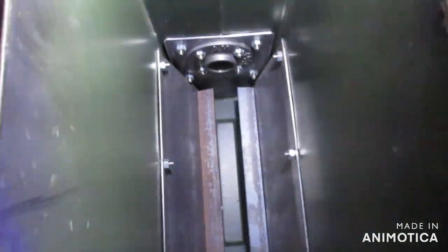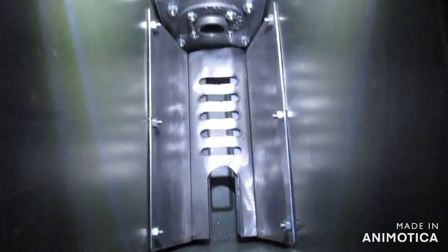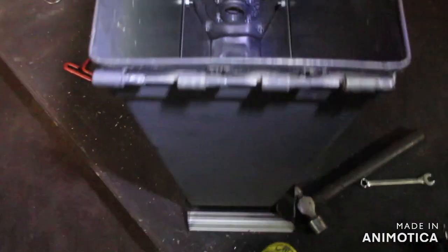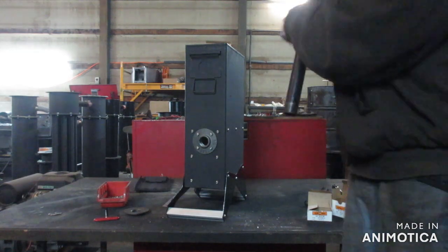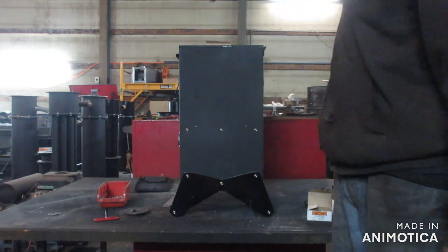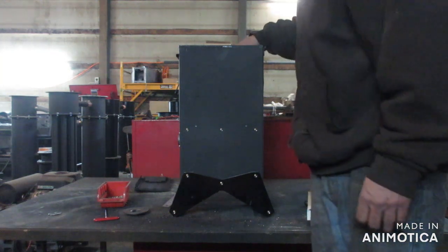This is what it looks like on the inside. I'm going to install the grate here — the grate just sets on the rails. The next step is to install our gas pickup tube, and I'm going to install mine on the inside. The big slot you may have noticed on the grate — that's what that's for, so this can extend through it and pick up the gas from the bottom side of the grate.